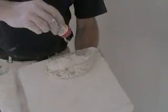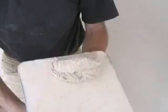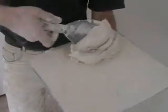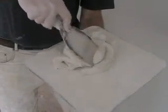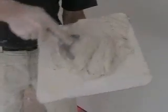With any small repair job I want to finish the whole job with only one mix of cornice adhesive, so I use salt mixed into a portion of the mix to make it set fast. Make sure the salt is mixed thoroughly to minimize scratches in your work. The more it's mixed the quicker it will set. This will allow us to apply multiple coats of plaster within 20 minutes or so and have the job finished.